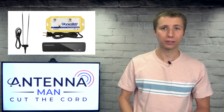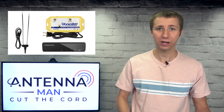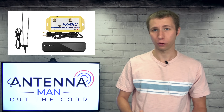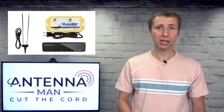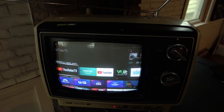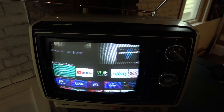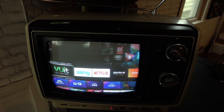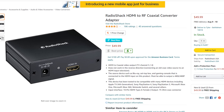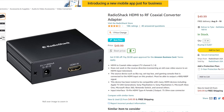Here's what you'll need to get started: a pair of rabbit ears, an amplifier, and a source that has an RF out for an old TV. This source can be a digital converter box if it has the output for channel 2 or 3. If your plan is to connect something via HDMI to broadcast analog — like a Fire Stick or laptop — you'll need an HDMI to RF converter. All parts are linked in the description.